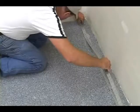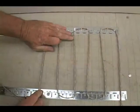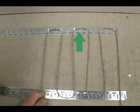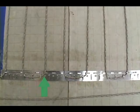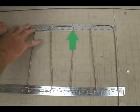Proceed with the installation as normal. You can vary the cable spacing depending on the heating load. Two-inch spacing is for rooms with lots of heat loss like basement floors and sunrooms. Use two-and-a-half-inch spacing for baths and most rooms. Three-inch spacing is more common in hallways and rooms with low heat loss.